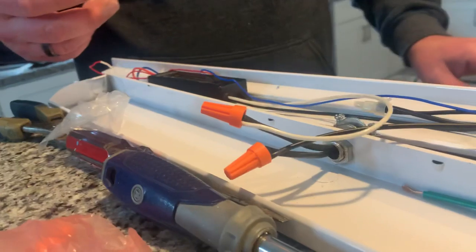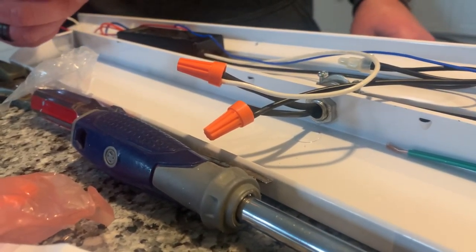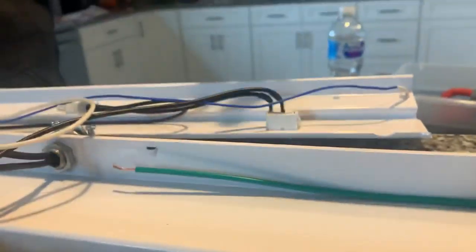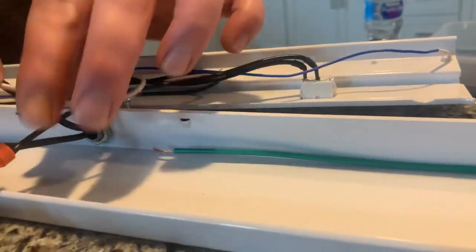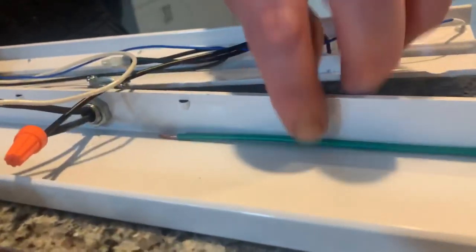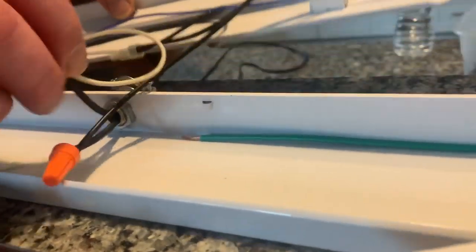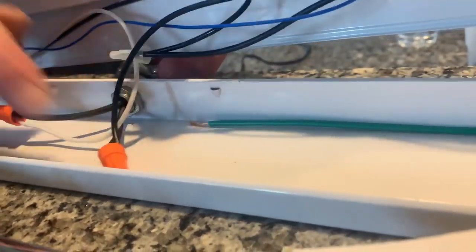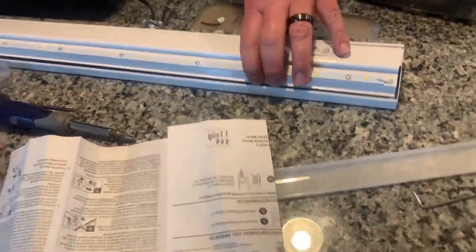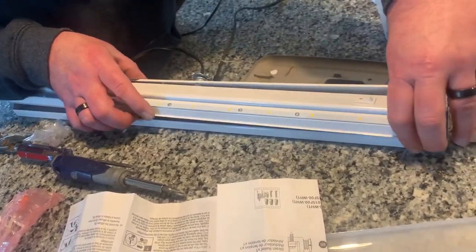Our pigtail is a basic pigtail — it does not have a ground wire. This box has a ground wire here, which is a body ground, which really needs to be hooked up. But wiring 30 years ago was only a two-wire system — it was a hot and a neutral. This ground is actually just another neutral with a little different purpose now. Now you put grounding rods in the ground to make a body green ground contact; before you didn't have to. So it will survive without it, but it's safer to have it.